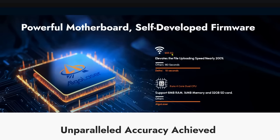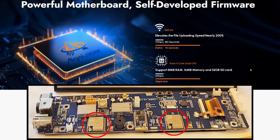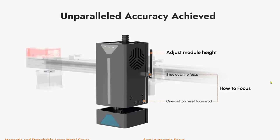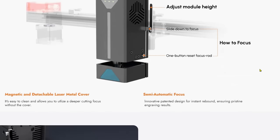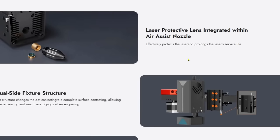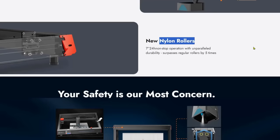It does have 5G Wi-Fi, which is very nice. The touchscreen has its own dedicated processor - it's a four-core dual CPU control board, which is why that touchscreen is so very responsive. The focusing accuracy on this is probably best in the industry that I've seen so far. The only way you could beat this focusing gauge would be with LiDAR, which we haven't seen yet - though I think the X2S1 has LiDAR, but that's a whole different class of machine. It also has nylon rollers, which last two to three times as long as the old style rollers.